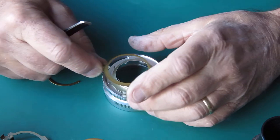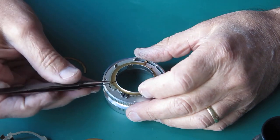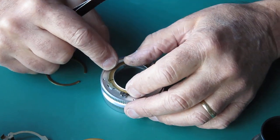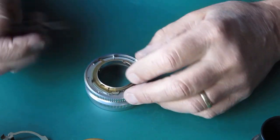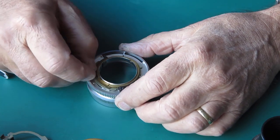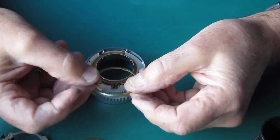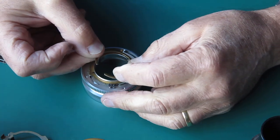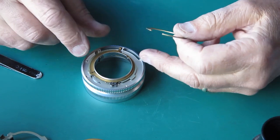This pointer goes in. That slot must ride over that pin on that other piece. And this should drop down to the lower. That's it. Let's put this piece in. Just checking the feel of that. This separator is a little bit tight where it fits over the centre. Just stretch that out slightly, see if I can release some of that tension. So I really want it to be able to float on there, otherwise if it gets pushed down it will hold this down too firmly.